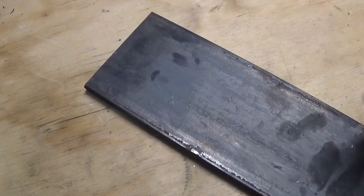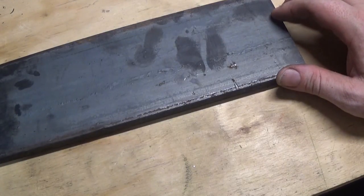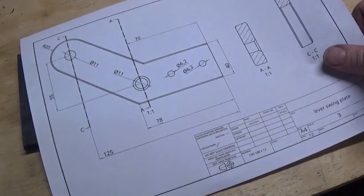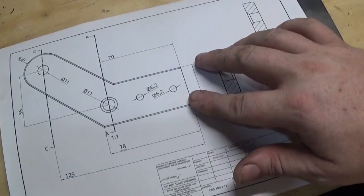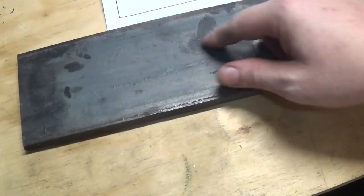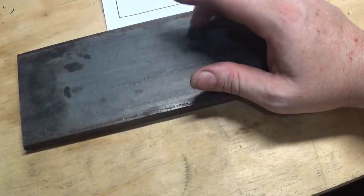Well look at that - it took me five minutes to unwrap that. It's certainly not going to get damaged in post. So this piece here I think is going to come out of the end here. The best thing to do probably is to mark it all out, and we're going to chain drill round the edge and hacksaw the rest off quick, then clean it up probably in the shaper if we can make it work.